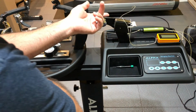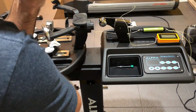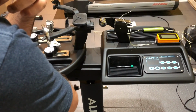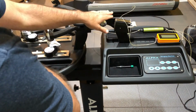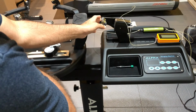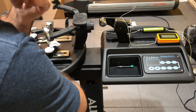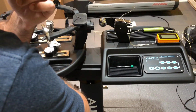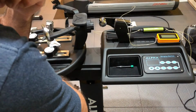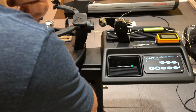There's a little bit of a debate on what type of calibration tool you should use. The one on the top here is a spring loaded tension calibrator. The second one is a digital one, which really just amounts to a luggage scale. There's an argument to be made that because of the constant pull, with the digital meter you won't get a very accurate reading, or you'll drive yourself crazy trying to adjust, because as you're trying to adjust, the tension head is going to continue to try to pull to maintain the reference tension. So it's much easier and much more accurate to use the spring calibrator. You just have to make that decision on your own. Listen or read up on both sides of that argument and make your decision.